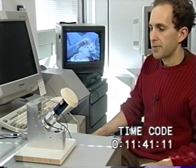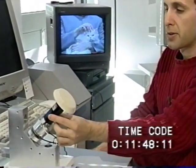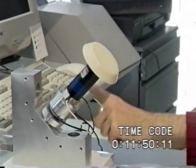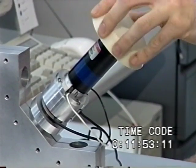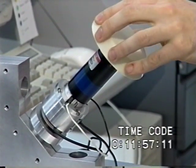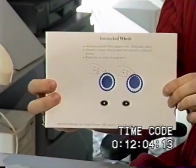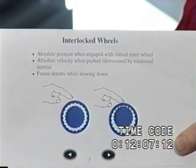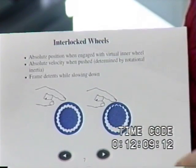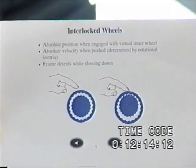This is a demonstration of an invention that we call the haptic clutch. We began using devices that just have a single degree of freedom, like this one — there's one motor — but we have four sensors mounted orthogonal to this degree of freedom. We realized that with this kind of setup, we can simulate this one degree of freedom wheel's attachment to an arbitrarily complicated inner model. In this particular example, we're attaching the outer wheel to a virtual inner wheel that has tooth bumps on the inside and on the outside of the virtual wheel, which we simulate in software.